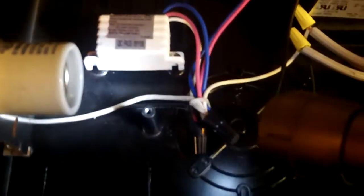Here's the cord coming in, and of course you've got the hot wire right here, and that's connected to the ballast. Then this red wire — there's a bunch of stuff right here — but the red wire goes to the igniter, which is this right here. And of course this blue wire is also connected to the igniter. Then these two red wires, which are from the igniter and the ballast, are both connected to the black wire to the socket. And then the white wire, which is the common wire, is connected to these two white wires which are from the igniter, and then back to this cord over here.